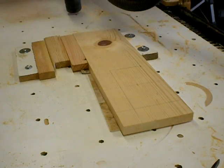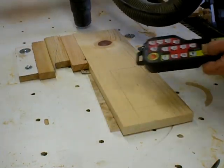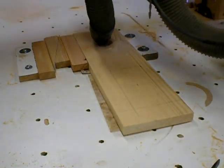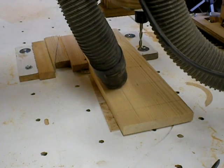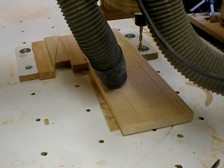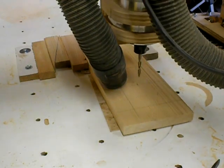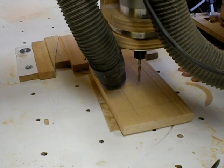So here we are — we've got a piece of wood drawn up for the square that we're going to put the part in, and our form of clamps is a couple of wedges between fixed blocks. So now we're using our pendant to drive the bit into our center position to where we want to start the code. With our pendant we can jog fast, jog slow, bring it down, slow the jog to a crawl — all with the pendant.